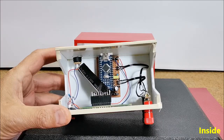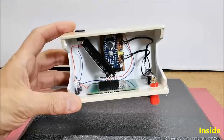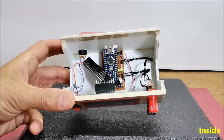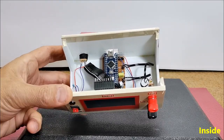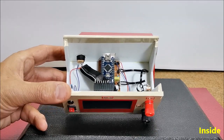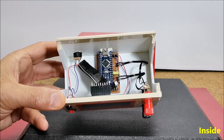The components are: an Arduino Nano microcontroller board, an LCD display 128 by 64 dots with ST7565 driver chip, two capacitors, one 10k ohm resistor, and one 1N4148 small signal diode. The components are mounted on a small universal PCB for compactness and better functionality of the device.